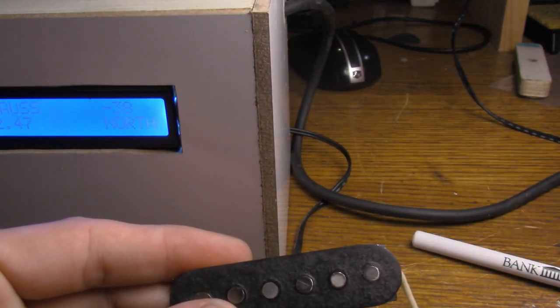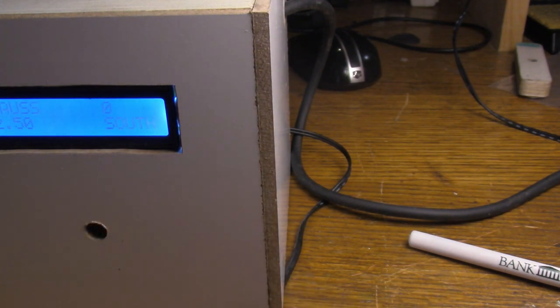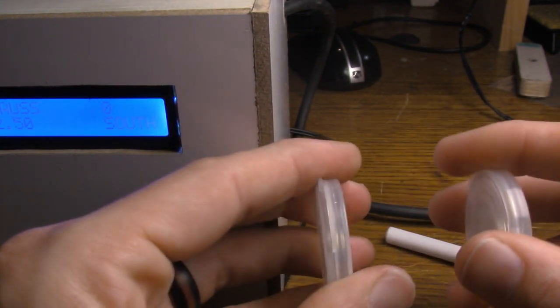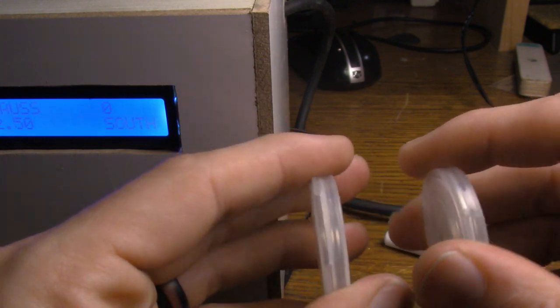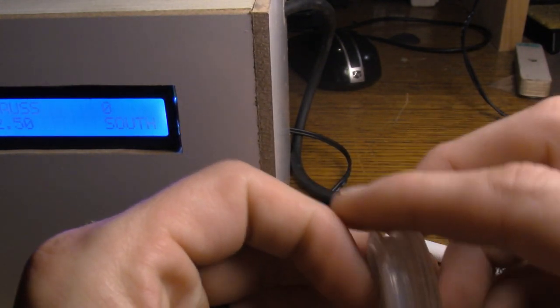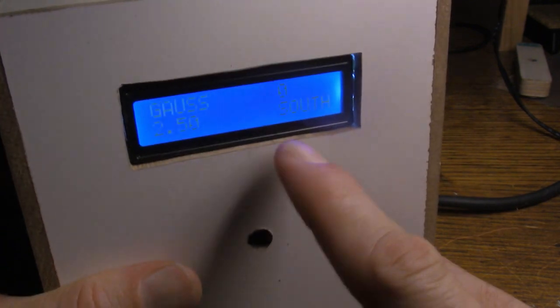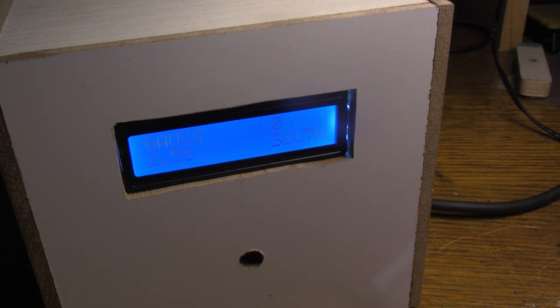Normally I take the magnets and put them on either side and run the pickups in between them, but these magnets are so strong I'm trying to do it with just one. I was shooting for between 500 and 700 gauss. If I put this thing in and it doesn't sound the way I want it to, I can tear it back apart and recharge the magnets stronger. I'll put a link to where you can find these magnets. Alright guys, I hope you enjoyed the video — if you're wanting to build a gauss meter like this, I'll put a link to a video where you can build one. If you want to build a pickup winder I've got videos for that too. Give me a like, please subscribe, thanks for watching guys.